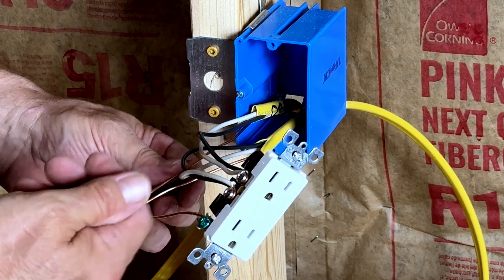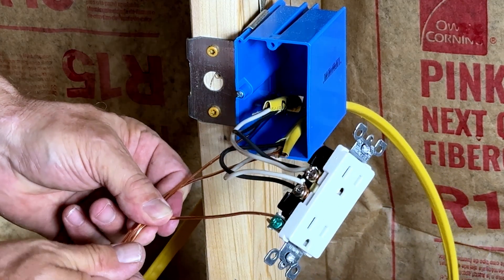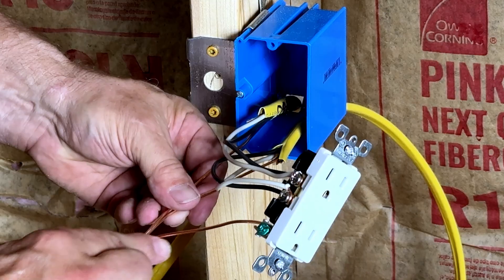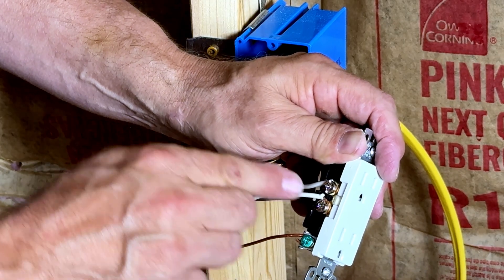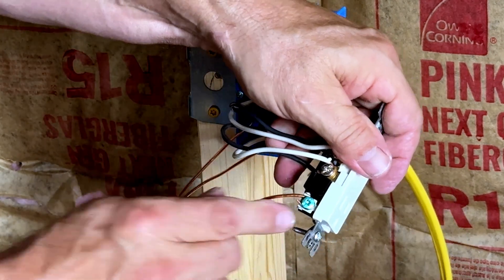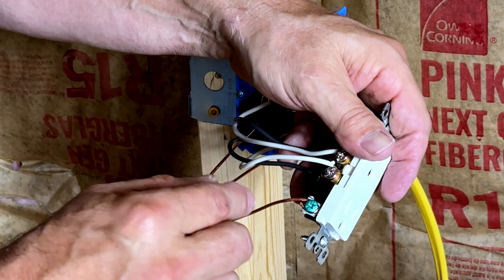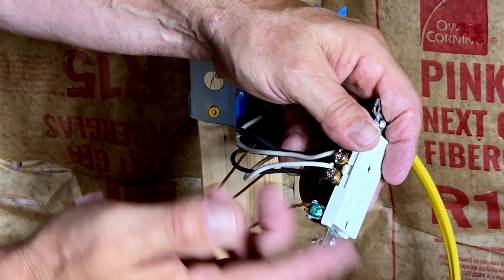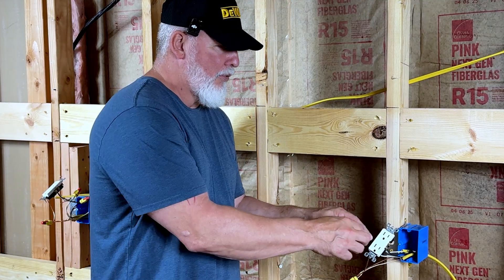I have seen people just twist the grounds together — that's really not the best approach. Even if you twist it nice and tight, you want a compression-type fitting like a wire nut or a Wago. Take the two together — the ground coming in and the ground going out — put a pigtail, and put that on. Make sure your connections are facing so the hooks are going in the direction you'll turn the screw so it doesn't unscrew it. Every one of these have tabs, and it's easier to show it on the ground — make sure the wire is inside those tabs. I like to use my needle nose and crimp those just a little tighter. As long as you're inside the tabs, you're great and good to go. That is daisy chaining using the actual receptacle itself to pass current through to the next one.